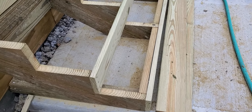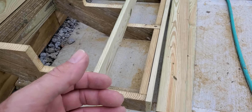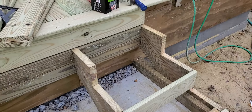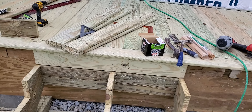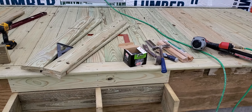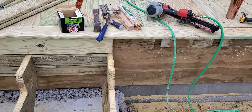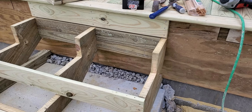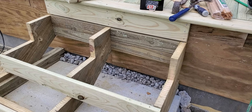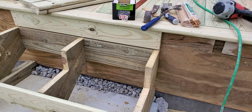If the post could come down farther or be buried in the ground it wouldn't matter as much, but I wanted to make this as strong as possible. That covers the cat's paw technique and the basic step framing. If you want to learn how to figure heights and all that, there are plenty of videos — that's a whole video in itself. This is a simple basic stair layout, covering all the basics of how to put it together and make it work.